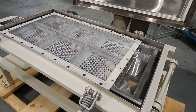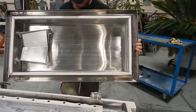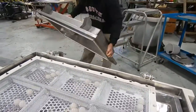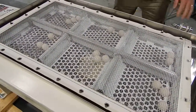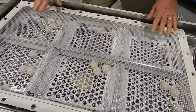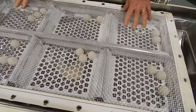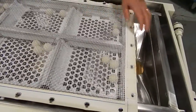Here's the inside of the unit. You can see it's a food-grade polish with a nice sanitary gasket. There's a little bit of residue from former materials it was processing. Here's your screen — this is a 20-mesh screen. It has balls in it so the bouncing action will help with fibrous materials, or anything that tends to agglomerate and gets stuck on the screen.